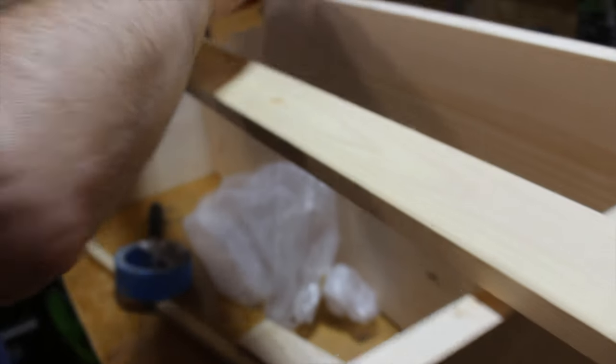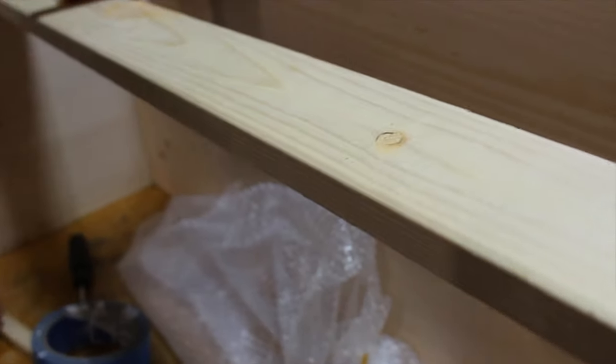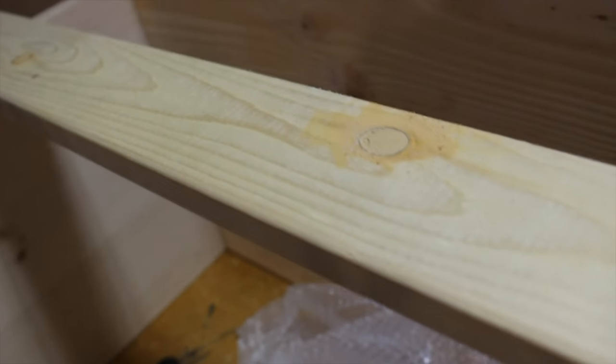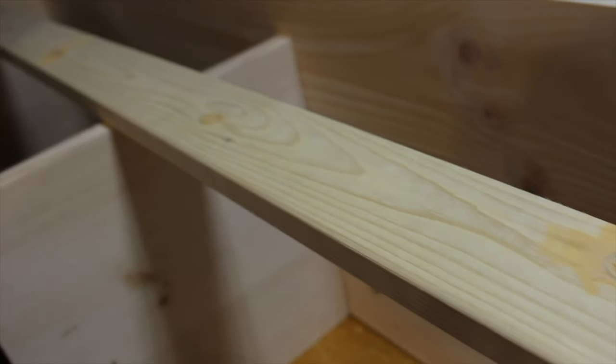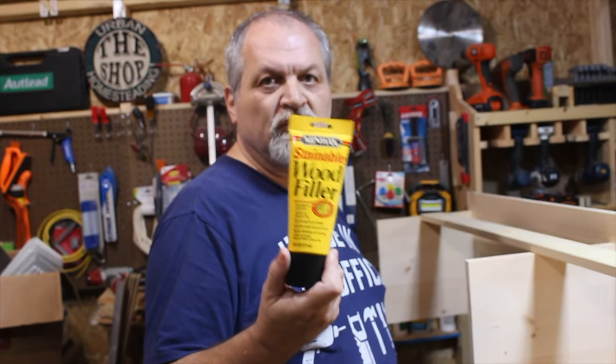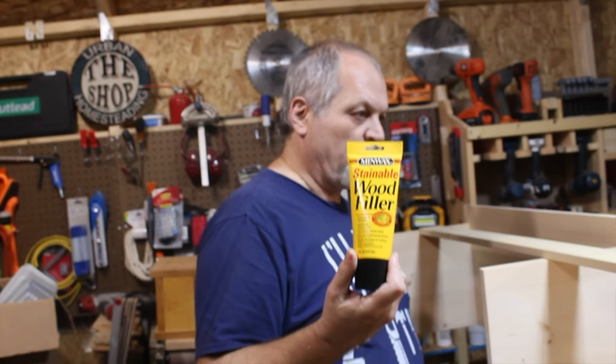I'm gonna let that dry. And each of these should dry pretty quickly because they're not huge, right? Well, this is pretty big, actually. That one? Okay, so that's probably the largest of them. And next time we go in the store, we are almost out of this. And this is a stainable. Again, we are not a sponsor, but because we're going to stain that, you need a stainable wood filler. Non-stainable wood fillers will just spoil your piece.